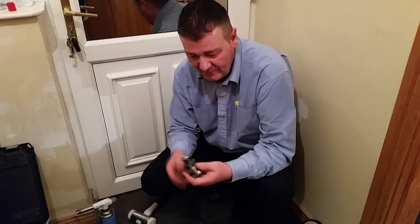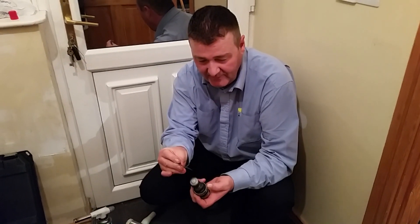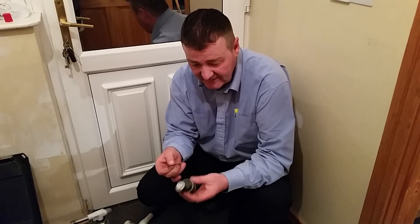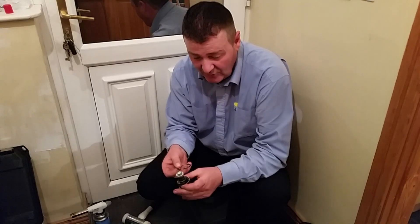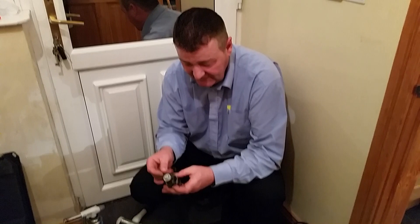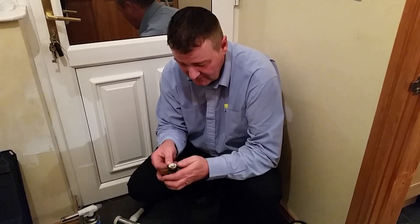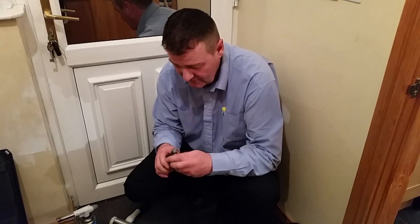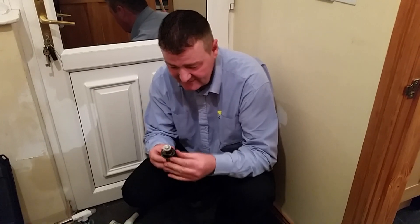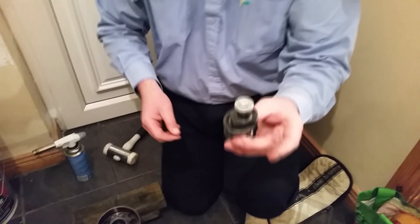It's important to remember before you put this in that you have a wee spring clip at the top. Obviously you had to remove that to get it out, and if you removed it you'll see that it's jammed underneath and it doesn't actually come out until the bearing has come out. What you need to do is put the clip on first — just clip her over so she goes underneath. See, it just sits like that, sitting underneath. Just have it like that.